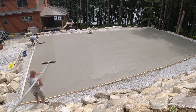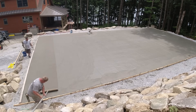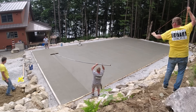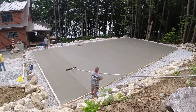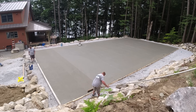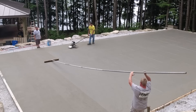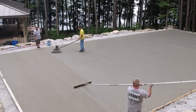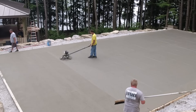What's kind of unique about this is we've never used that little 30-inch lightweight power trowel you can kind of see in the background to finish on a job like this. Normally on a broom finish we'd get on this with knee boards and a couple guys would be mag floating it out by hand. Today we decided — we've had this little mini trowel from Tomahawk for quite a while, it's super lightweight, weighs like 30 pounds, one guy can pick it up really easily — let's try it and see if it does all the work for us.